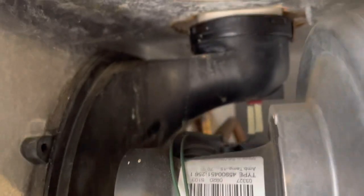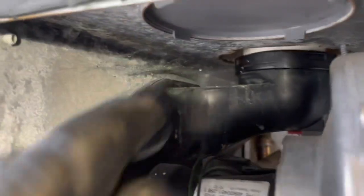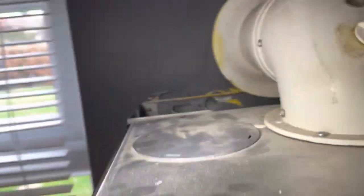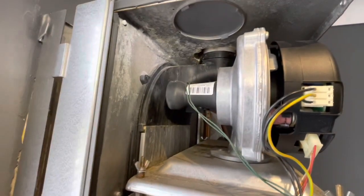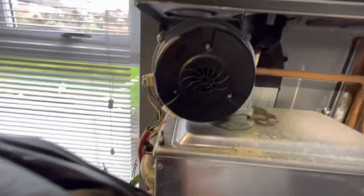I've had it dry since you come last time. So that's split inside there and the water's running down onto the top of the burner there — that's where your water's coming from. Well at least that's an easy fix, innit? Just a flue seal, innit? Gaffer tape.